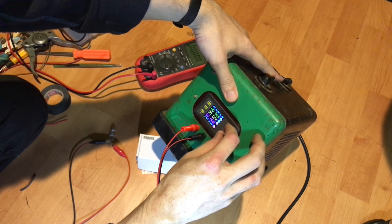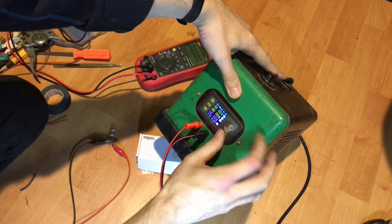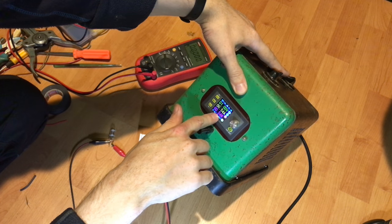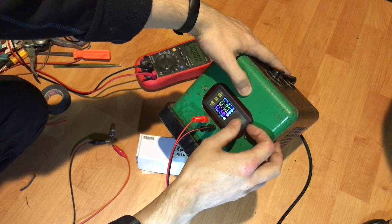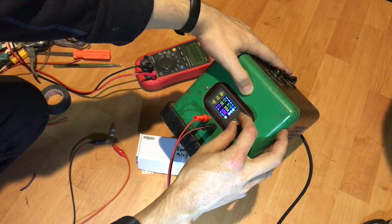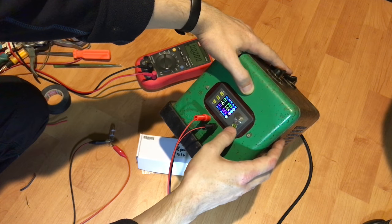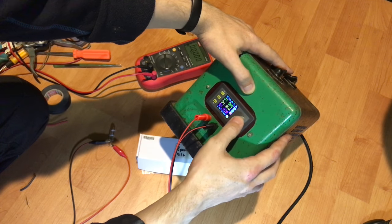Now I can set things before I turn it on, and I can set the things while it's on. So this button turns it on, and it's showing me it's drawing 0.5 watts, but the bulb doesn't light up at that low voltage, so let's increase the voltage to 3 volts, 4, 5, 6, 7, no, let's bring it back to 4, let's increase the amperage. How do I do that, please? Okay, this way. 2 amps.